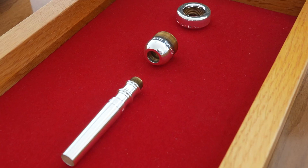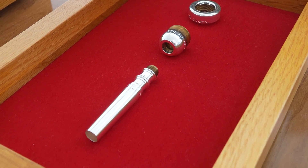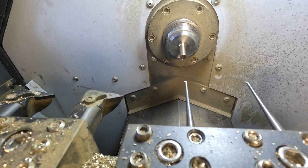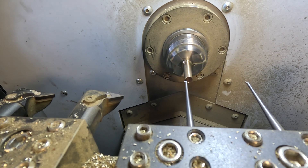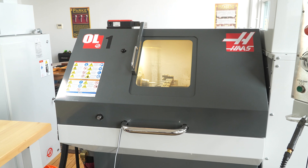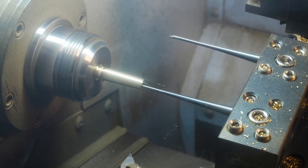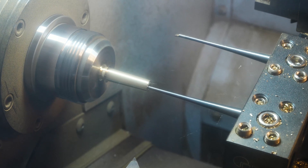They're very small — the internal bores are very small. It's a lot of detailed, intricate work. The difference between one size and the next size over is only two and a half thousandths diameter difference. So obviously that's a fairly thin cut. You can't have a lot of tolerance issues or you're closer to the next size than the size you were supposed to be cutting.